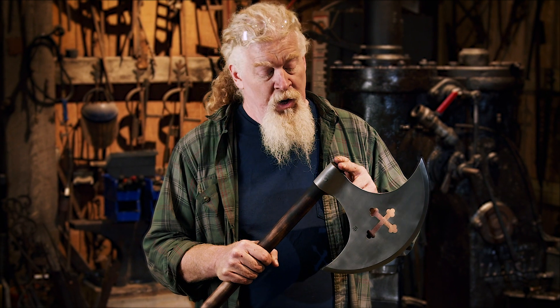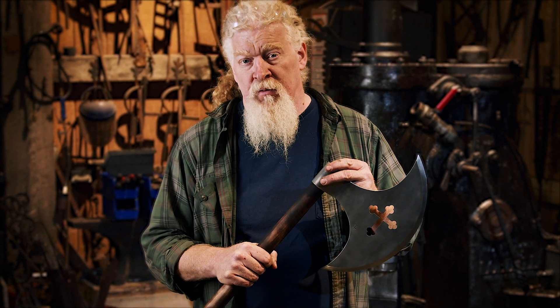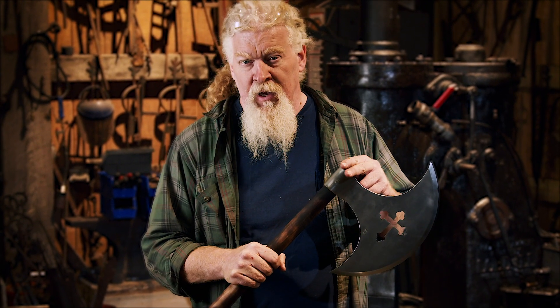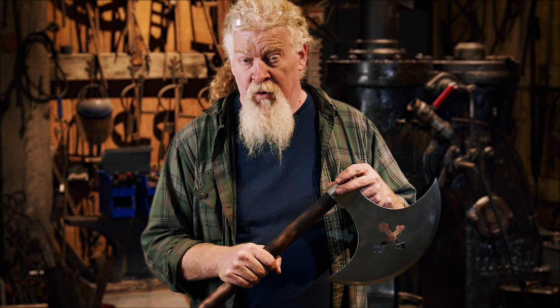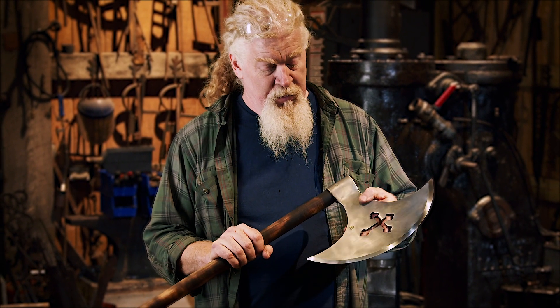If they're only wedged, for any of the guys that are really hitting stuff with these, they can get loose and we'd be worried about them sliding off. So we wedge and pin, which gives the piece a lot of integrity.